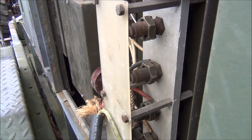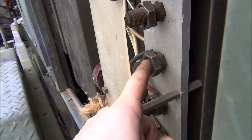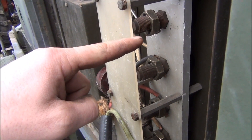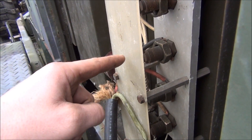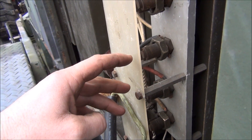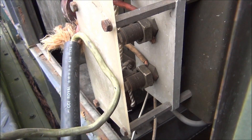When hooking up a three-phase generator to supply single-phase power, you just hook your two hot legs to any two of the hot legs coming from the generator — line one, line two, or line three. Just pick any two; it doesn't matter which combination you choose, and it doesn't matter which gets connected to red or black. Then hook your white lead (the neutral) up to L0. That's all it takes.